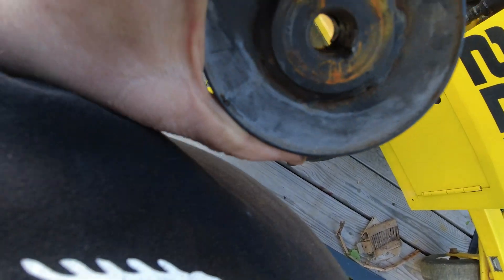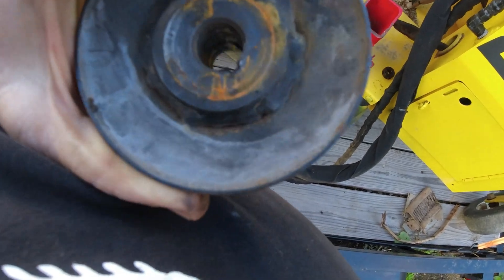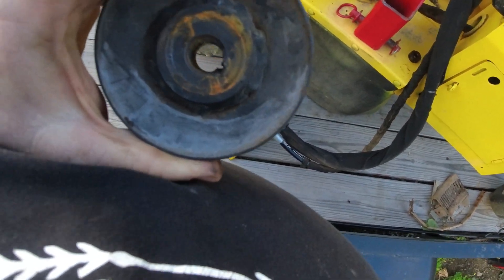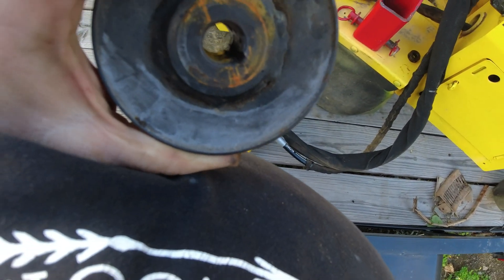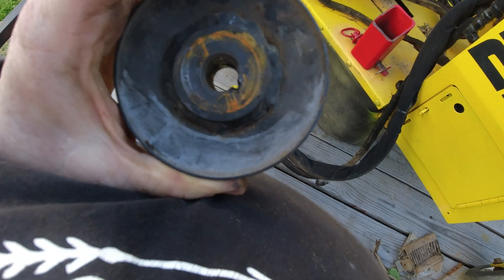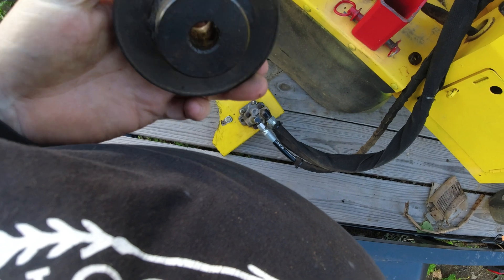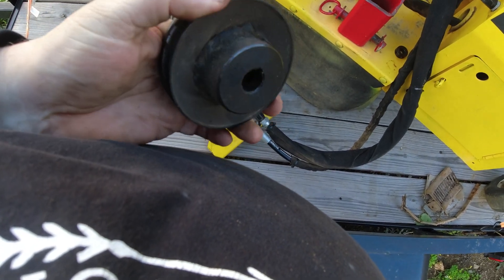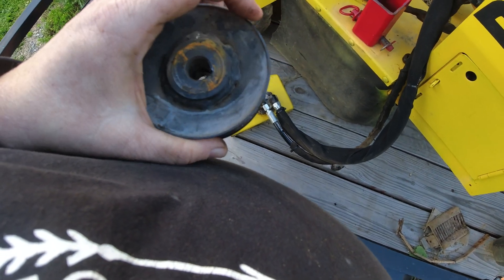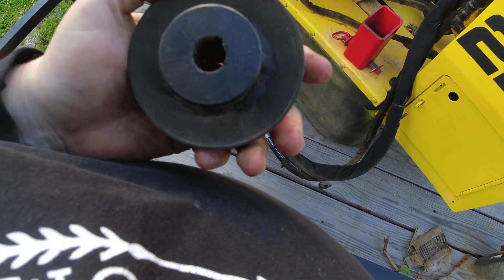I finally did get the pulley off — I had to put the set screws in place to actually grab and just pull it straight out. I have to figure out what size key this is; I should be able to get a replacement, hopefully no problem. Maybe run over to Harbor Freight and see if they've got keys over there, but that's actually a pretty long key. What I do remember is we actually had to make this pulley to go on the hydraulic pump because it didn't fit the engine — the engine is different. But we'll see. See you next time.